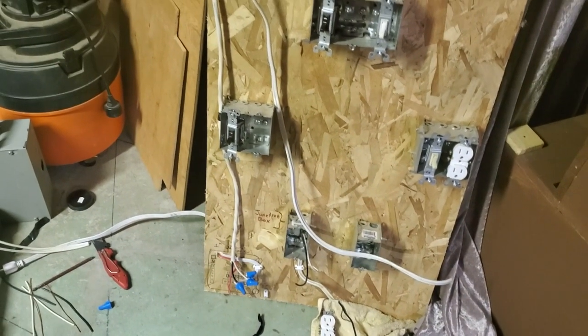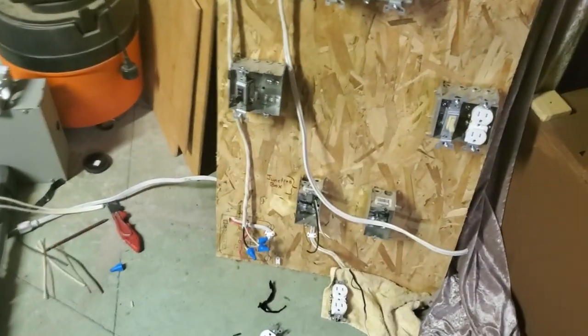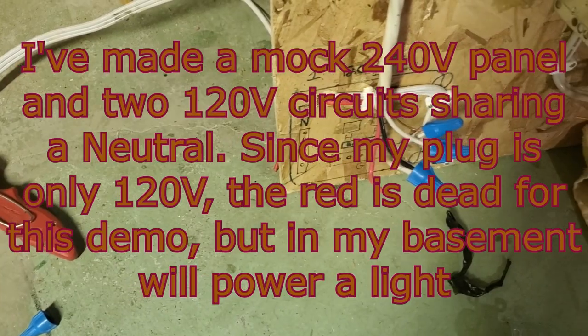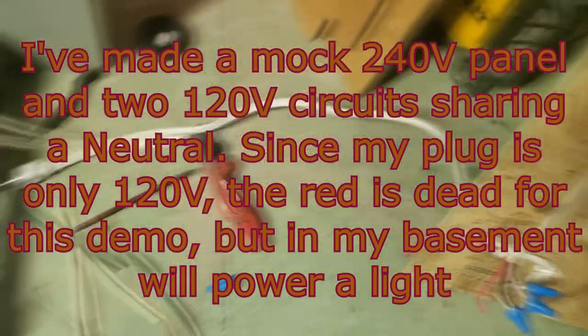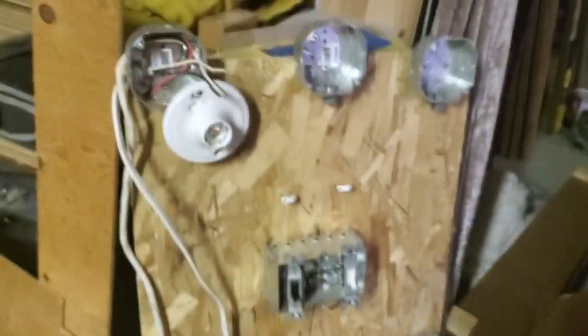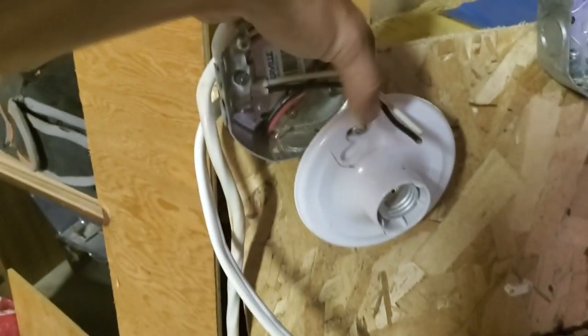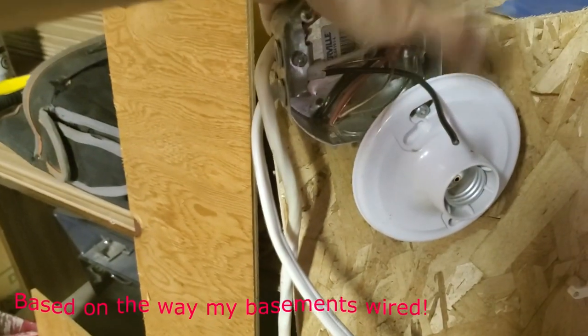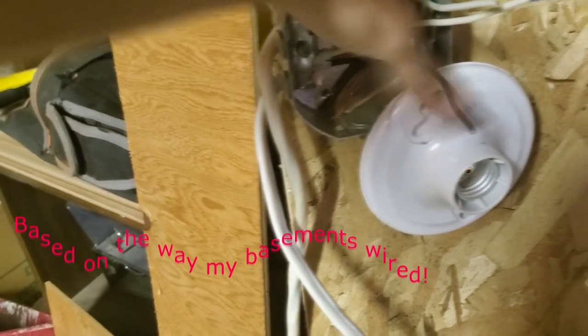Then you can go all the way, wherever you want. I'll show you how to wire a plug and a light while we're at it. This is just a board I made — a mock power supply. So you got your neutral bar and you got two hots, you're 240. You got your ground bar, that's a plug-in. I run 15 amps through it and apprentices use this. The red would tie into my light, so this light won't actually be functional because I'm using the black. The neutral is shared for both the red and the black — those would go together, reds would go together, blacks would go together.